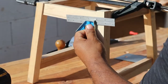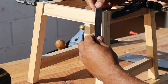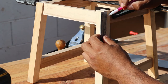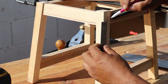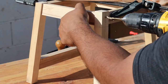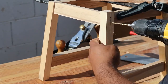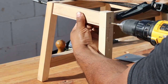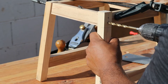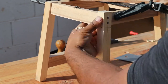My bench is made out of Douglas fir, not hardwood, because I'm not a billionaire. I went with Douglas fir which was only a million dollars. I'm just eyeballing where I want two dowels and one dowel — I think that ratio pattern will look really good. I'm using a pilot hole before going up to a quarter inch. The dowels came out pretty good. Walnut would have been nice but red oak has a pretty good shimmer and contrast to the maple. The legs are hard maple and the cross members are ambrosia maple for contrast.